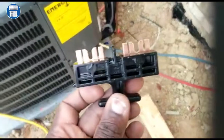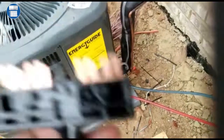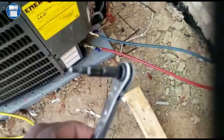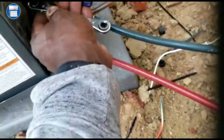This is the disconnect — I have it in my hand right now. I'm gonna put it back on in a minute, but before that, the first thing we want to do is shut off our liquid line. We have this service tool here, so let's go ahead and shut off our liquid line all the way.